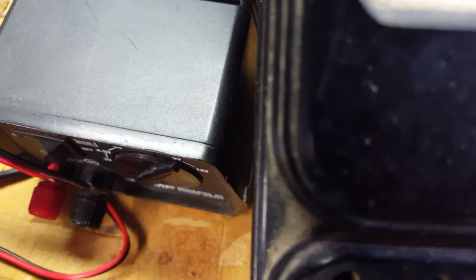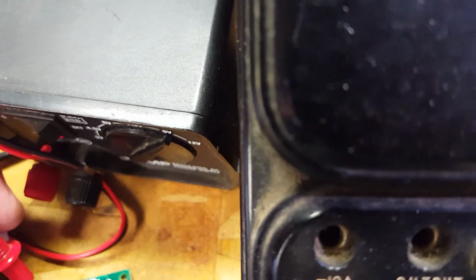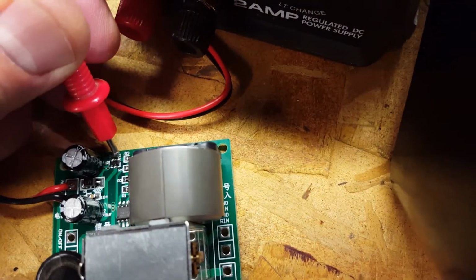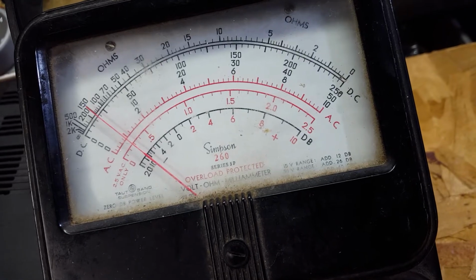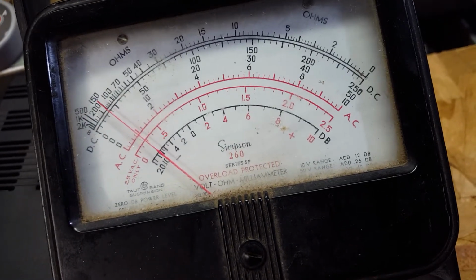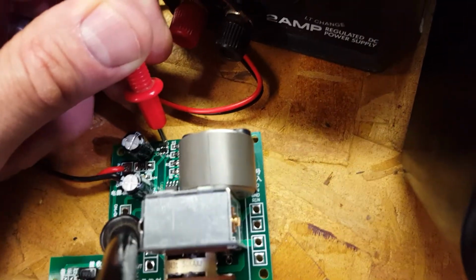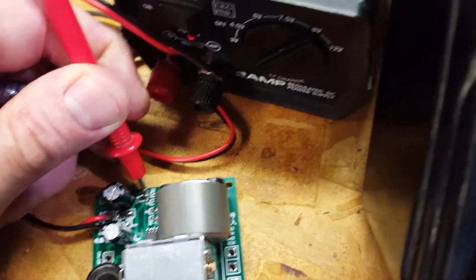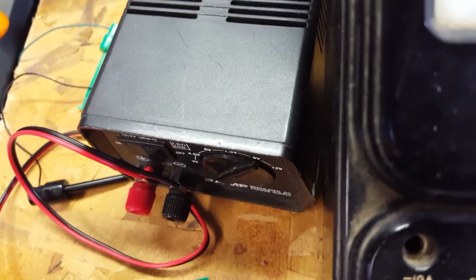And we checked back there. The terminal here is the collector, and here at the base, on the right hand terminal of it, is the base. And we do have some voltage there, about 1.5 volts, not even 3 volts. But we do have some voltage there, and some current to supply it with, and that's supposed to turn it on. So there's nothing there coming through the collector.